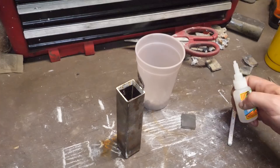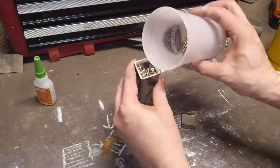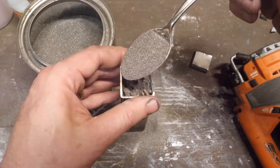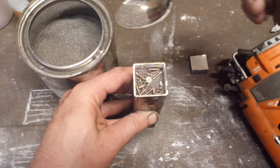Let's finish laying out the canister and get it ready for the powdered steel and the screws. This first knife is going to have 1084 steel powder mixed in with the screws — it's going to provide a nice contrast with the nickel plating, which should etch very brightly. The next canister has no powdered steel filler; it's just going to be screws pressed tightly together, and it should be a very different pattern.